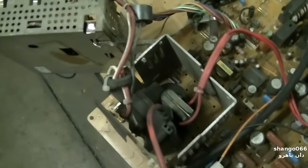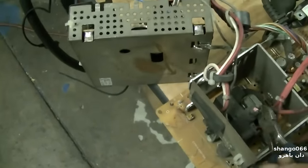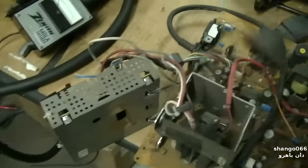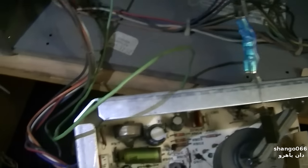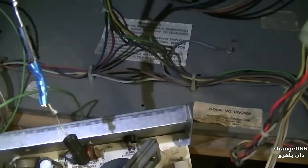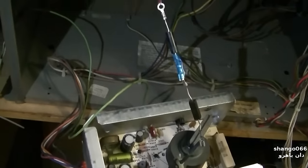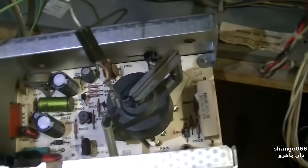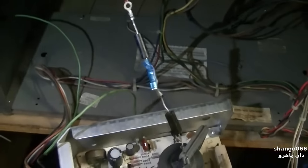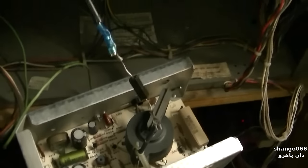The first thing I'm going to do is cut this lead off so I can use this to test our subject. The chassis is plugged in, it's grounded both with a clip lead and it's wedged in the chassis there. I got the two microwave oven diodes - everything is out in the middle clear of everything. We're going to power this up and see what happens. This thing runs at 25 kilohertz so we won't really hear it squealing, and I just hope those diodes are fast enough. I hear high voltage!